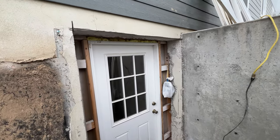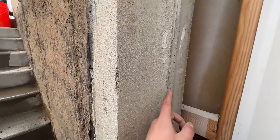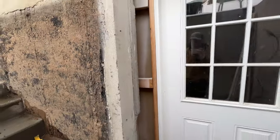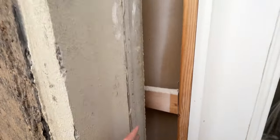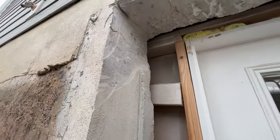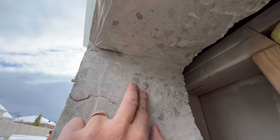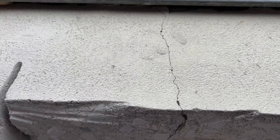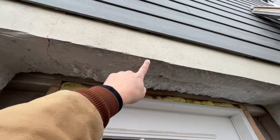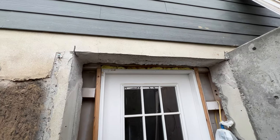This is the walkout entry and this is the doorway. This used to be a window — you can tell because there's this shape in the concrete and some silicone left over from where the window was sealed. They cut the bottom open and you can see where the saw cutting took place. There's no reinforcement in here, the rebar — two pieces — are cut. This whole header is essentially unreinforced, and there are several cracks that have formed over the last few months into winter where it is actually completely fractured through in five places. This definitely needed to be reinforced before the concrete cutting happened.